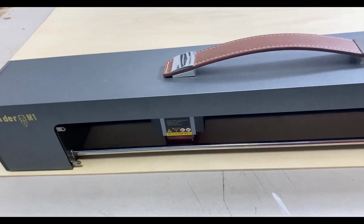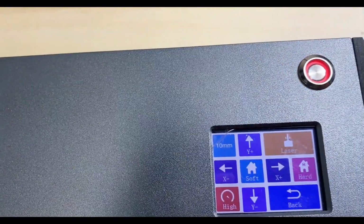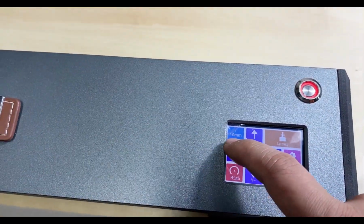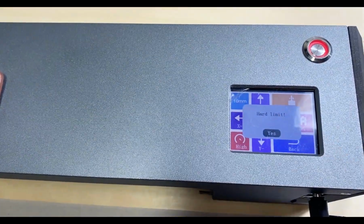Put the laser engraving machine on the engraving material. The 3mm thick basswood board is used here. It is worth noting that the work surface will be burned during the cutting operation. If necessary, use waste wood boards on the work surface to protect it.